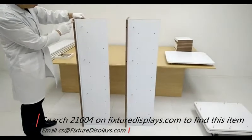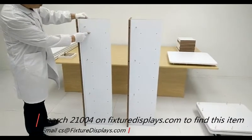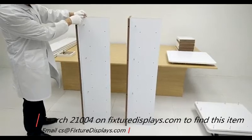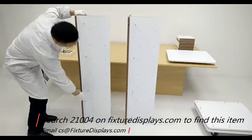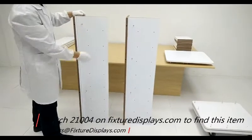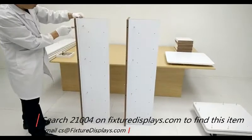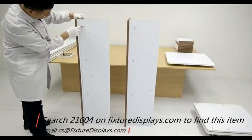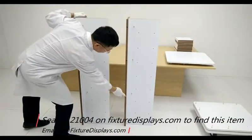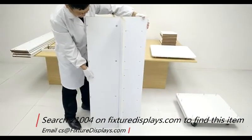Now you can turn the cam clockwise. Make sure there's no gap or very little gap — if there is a substantial gap, make sure your cams are starting in the right position. You also want to double-check the top-level hole to the edge: the one that is further or longer should face down at this stage. Make sure the two units you're looking at have consistency in that regard.